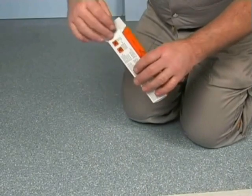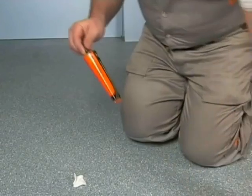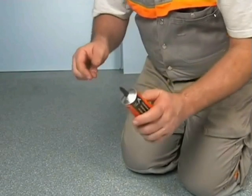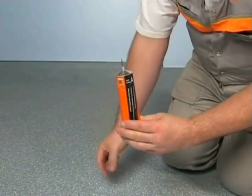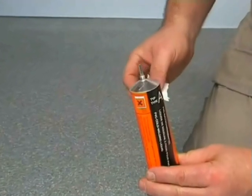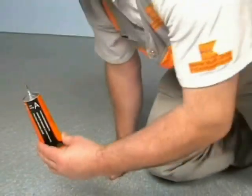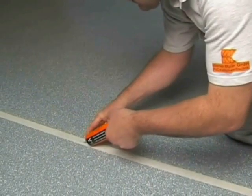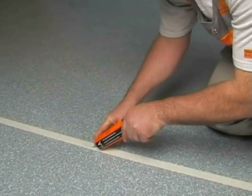This is our PVC cold welding liquid type A. Shake the tube well before use. For the close cut seams which usually come with newly installed flooring, cold welding liquid type A with a firmly mounted needle in the middle should be used. Clean the nozzle and needle before use with a clean cloth. To apply the liquid, press the needle firmly into the seam and guide the flow of the liquid along the edge with your free hand.